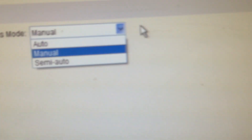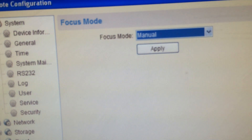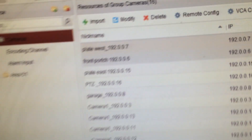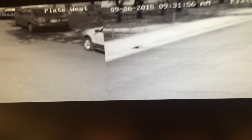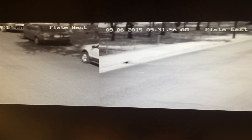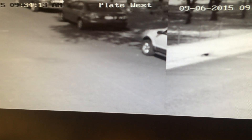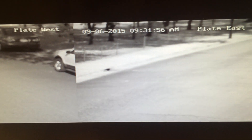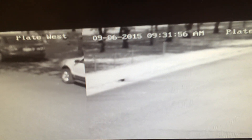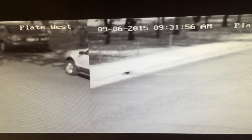Focus mode is set to manual — it gives us three options to choose from: auto, semi-auto, and manual. I'm leaving it in manual because we don't want it to change focus. We're only operating in black and white. To accommodate the daytime-nighttime switch for the 700 nanometer IR, I'll do the focus adjustment in the evening when there's still ambient light and the IR has come on — that puts me right in between.